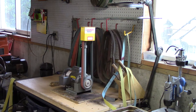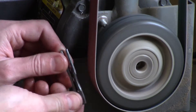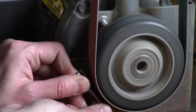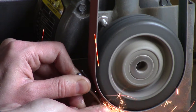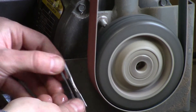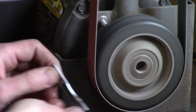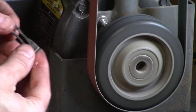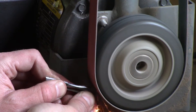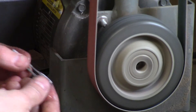After it's cut, shaping is simple. You could even do this with a bench grinder or a flap wheel if you didn't have a sander like this one. I'm cutting out these small notches so that the tweezers are easier to squeeze — otherwise they're quite stiff. You'll have to grind these and just kind of feel as you go along. If you get them too thin, they're going to be too soft and won't spring back. If you don't grind them enough, they're going to be really tough to squeeze.